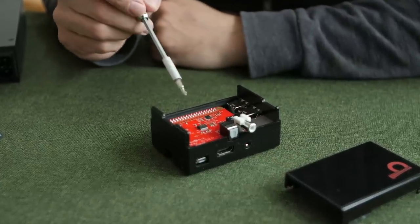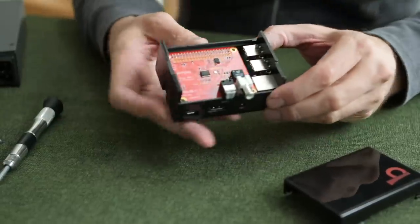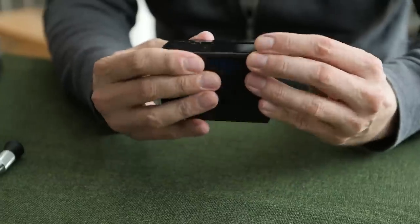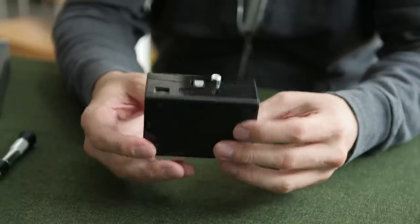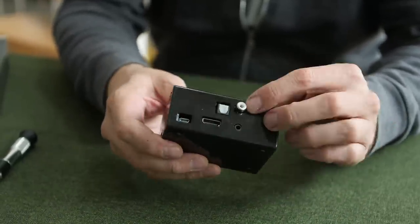From this point, all I want to talk about is S/PDIF. We're no longer in the USB game — we'll leave those USB ports on the Pi for attaching storage for music. Our audio outputs are now converted to S/PDIF, which makes for a better sounding device. This HAT is from a company called JustBoom, it's called their Digi HAT. I've put it in their case and I'm going to clip on the top.